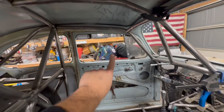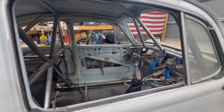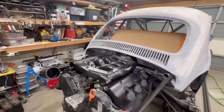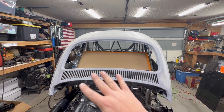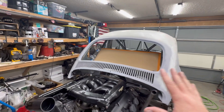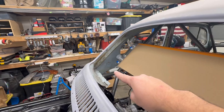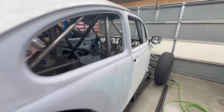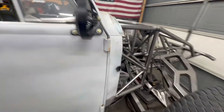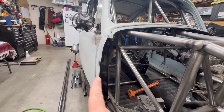We're going to put some probably right up here — one or two up here. One of the main issues is, and the reason I need to do this now, is I'm going to have the intercooler right here and I'm going to have to cut out some of this portion. I don't want to do that until I have the body attached to the chassis fully so that way it's not flexing and moving even more. So I'm going to put some attachment tabs back in here up to the stronger parts of the body, and then add some tabs all the way up here in the front end. I need to make sure I attach somewhere in here that's going to strengthen up this door.